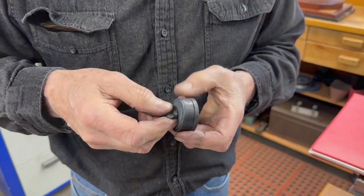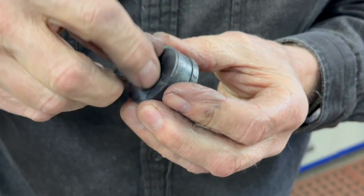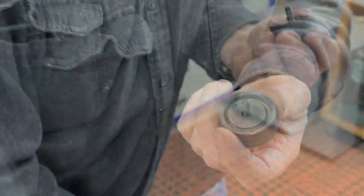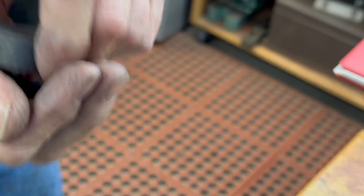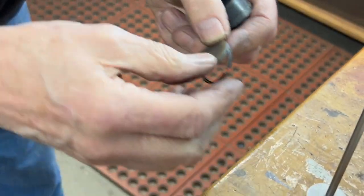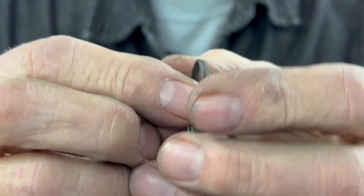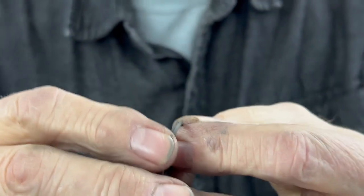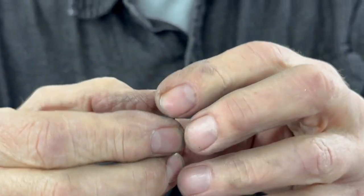It's a little more work but I like this method. It's cooled off now. We're going to take it apart and see what the rings look like — take these out of the container. You can see it's pretty black after being heated up red hot. There are the rings with the little pin gap. Notice the paper's gone. That's the piece that was in the gap. As you can see, the gap is still there, so it's got a little spring to it. Hopefully they're perfectly round. The next thing I'm going to do is put them in a little lapping fixture that I made for these rings and check how round they are.